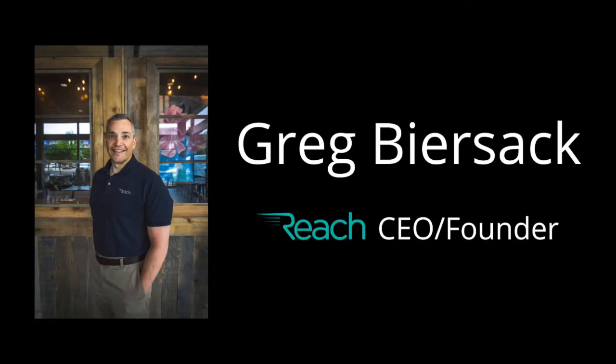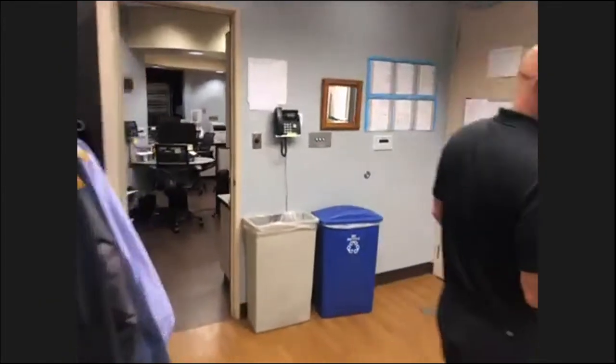Great. Why don't we head on over to where the amalgam separator is, and talk a little bit about some of the things associated with the mechanical room. Sure. Every office is going to have a different compressor, vacuum system and amalgam separator. Amalgam separator systems are for collecting heavy deposits, mainly amalgam, any kind of mercury, any kind of heavy sediments. It depends on what state you're in. Oregon and Washington require it. Some states aren't required yet, but it's coming about.